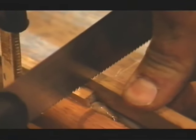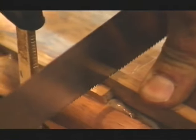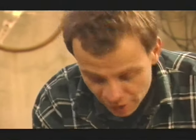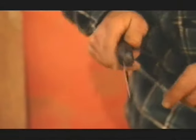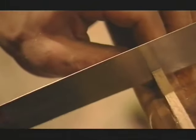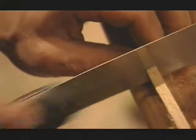It's quite easy to trim to length here because we've got a nice easy overlap. Now this saw is a Japanese pull saw. The Brits for years have used little tenon saws with a hard back that cut on the push stroke, but the Japanese pull saw cuts on the pull stroke. Because it cuts on the pull stroke, it's very, very thin — it doesn't need much effort and it's also very sharp. That's ready to drop in, so whilst that glue's drying, I'm going to clean up the rest of the other side.